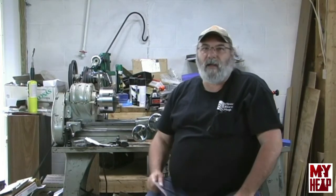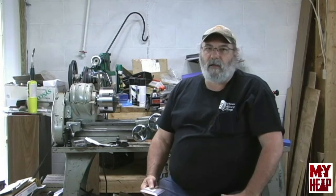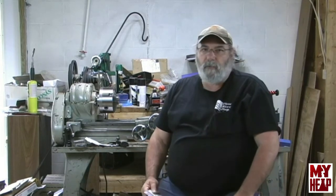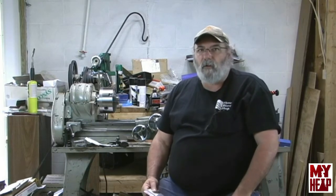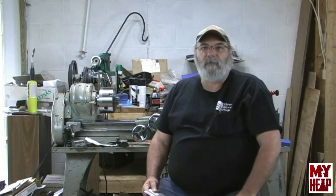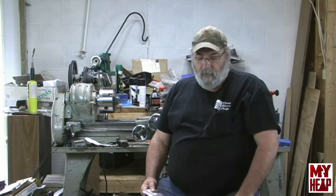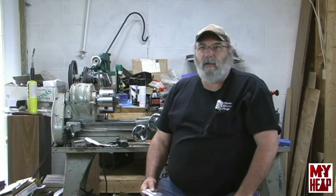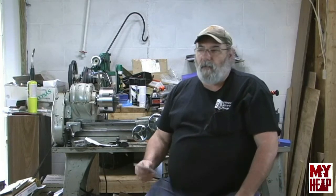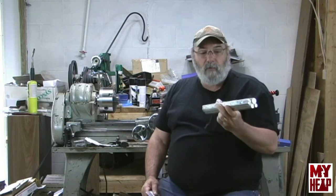All right, so the next YouTube shop student video, I kept asking folks, hey, what do you think I'd do next? Because I'm a rank beginner, and I had a couple suggestions, and somebody suggested that I do a captive nut puzzle. I thought, hey, that would give me an opportunity to do some grooving, some threading, some facing, turning to diameter, a whole lot of stuff. But I've been collecting the stuff together for that, so I've bought some 12L14.